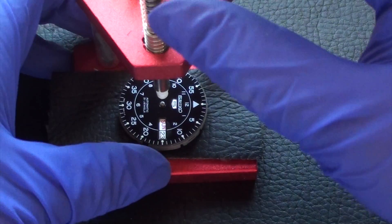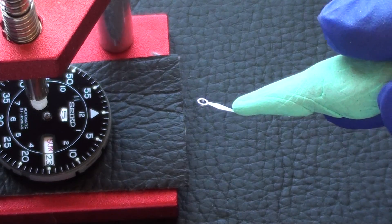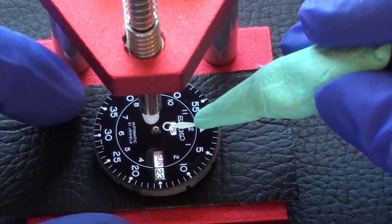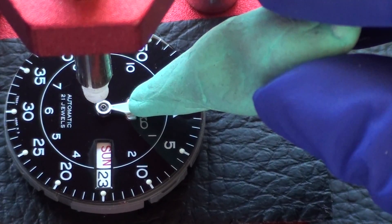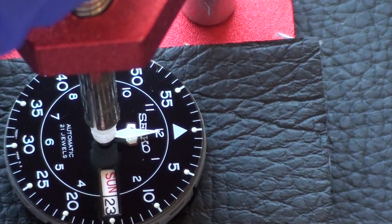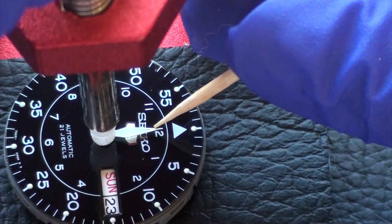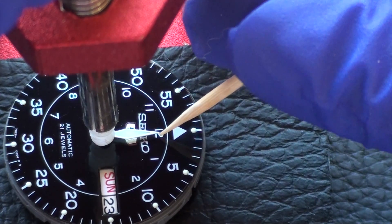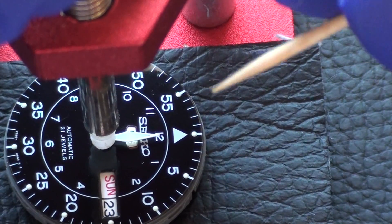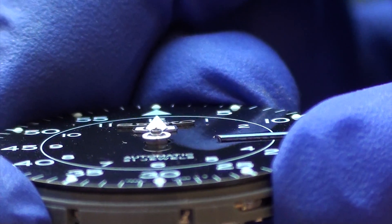Align your cannon pinion with the tool so it's perfectly centered. Make sure you have the correct size die. You can either use Rodico or your tweezers — I like to use Rodico when grabbing the hands because it won't be hard enough to scratch anything like tweezers can possibly do. Once you have the hand attached, align it up with the cannon pinion like so and push down to grab the hand. What I like to do is get a toothpick to help me align the hand before really pushing it down for good. Get it centered as much as possible, and once it's centered, push down. Don't push too hard, otherwise you can run the risk of bending the hand. After you set the hand, take the loupe and make sure the hand is seated properly — in this case, the hand has seated pretty well.